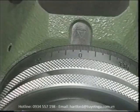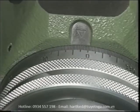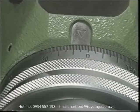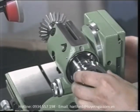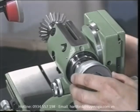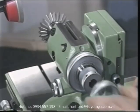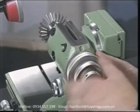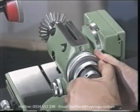A disengageable stop for fast setting to the 90-degree position enables faster adjustment of the index head parallel to the tool slide. The radial fine adjustment of the indexing spindle, which utilizes a worm gearing arrangement, is especially practical for precise setting up. The integral indexing attachment with exchangeable index plates allows easy one-hand operation. Depending on its length, the tool can either be fly-mounted or located between centers.